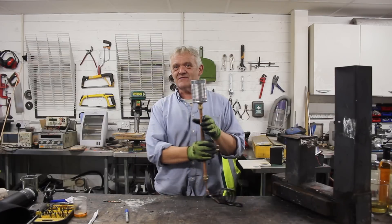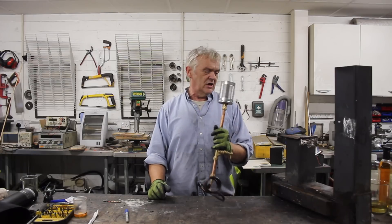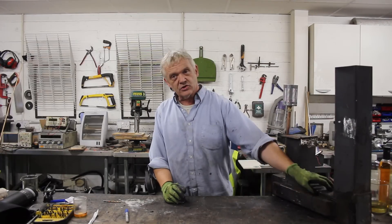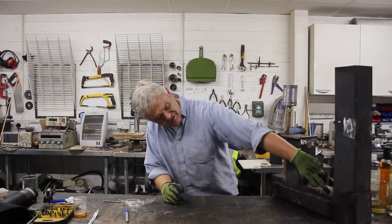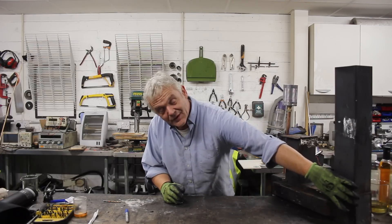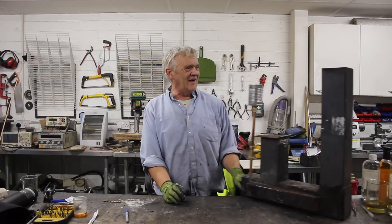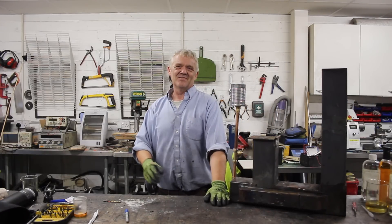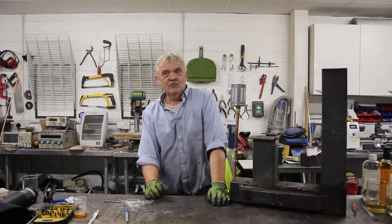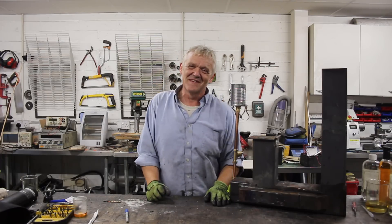I thought it was awesome to be honest. Now as I've said, this is a prototype, so I probably won't use copper — I'd probably use steel. It burnt with quite a yellow flame, and that's really lack of oxygen, so some more oxygen holes here would probably work really well. The coil actually sits about there, but it might be better to move the coil into this region because you've got this extra air intake and that's going to be a really hot region. Put it there and get some more air holes in. But there you go — we have made an oil and biodiesel burning rocket stove. I hope this idea inspires you, and I hope you do some of your own — let me know how you're getting on. Thank you very much for watching, and please do remember to like and subscribe.